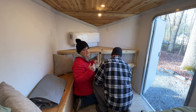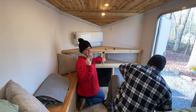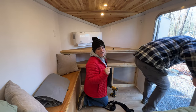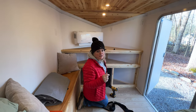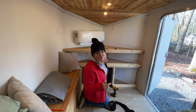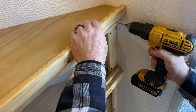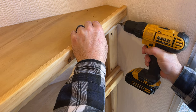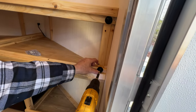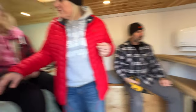We're going to drill a pilot hole first because this wood is small and the screws are bigger — it cracked the wood without one. So depending on how big the wood is that you're screwing into, you may need to drill a hole first.